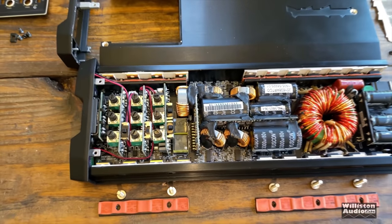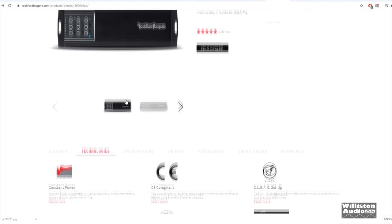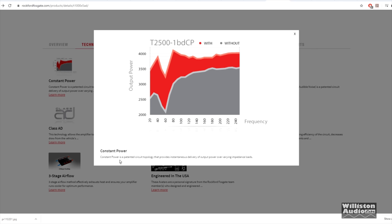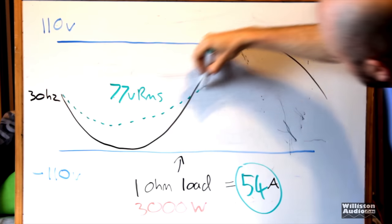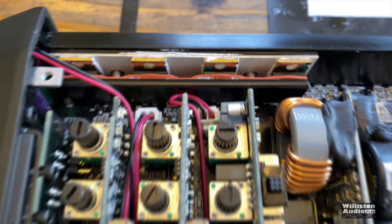Either way, this is a lot of power and a lot of channels in not a lot of space. Both the four-channel section and the sub channel deliver constant power across a range of impedances — 2 to 4 ohm on the four-channel section and 1 to 2 ohm on the sub. Apparently this is Rockford's patented constant power technology, so its design will differ from the likes of the Smart 3, but it'll still be some form of signal limiting based on output current sensing. If you want to learn more about current mode clip, go watch my explanation in the Smart 3 overview video — link in the description. I am absolutely in favour of constant power amps and look forward to seeing it spread throughout the market.